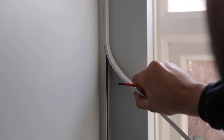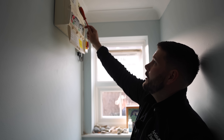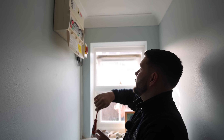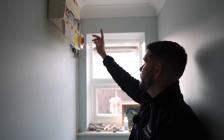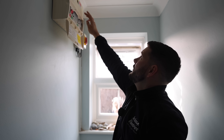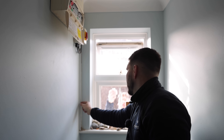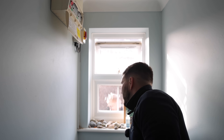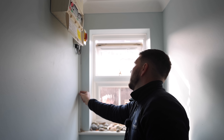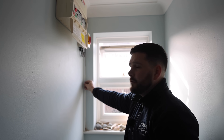So as I explained outside, we're just going to run a 4mm and follow the exact route they've used for the solar. I've just taken off the trunking which is here — it's come out the top there, come along this trunking and outside the wall. But it's rather tight in there. I'm not actually sure whether we'll be able to fit another 4mm, so we might have to think of something else, such as making the trunking a bit bigger.